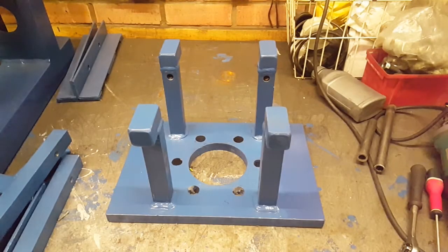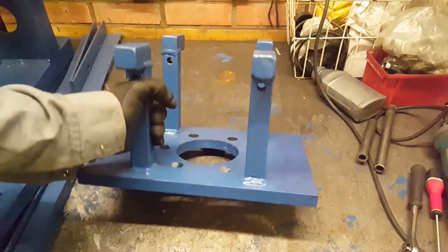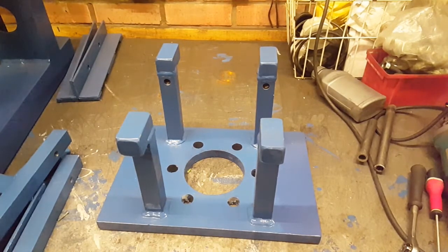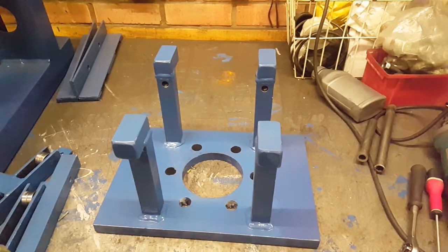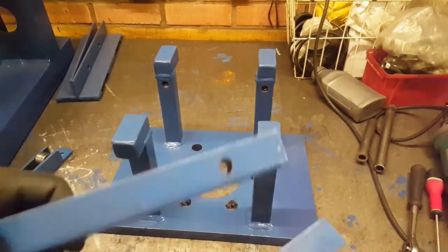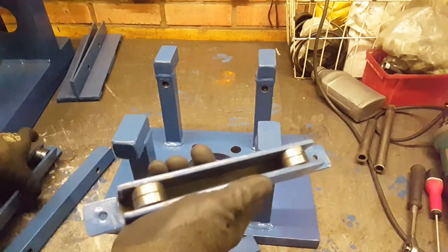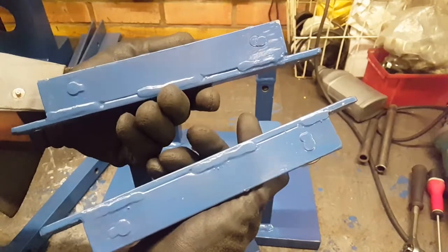This is the carrier for the cylinder. It was a piece of 20mm plate that I had cut — it's all laser cut, because there's no way I was going to do that with my plasma gear. It was 15 quid including all the cutting — I just gave them the dimensions of the cylinder and they did all the programming. I've welded these bits of 30mm solid bar on, and I've got two little trucks with cheap Chinese bearings which do a top job. They're just welded in — I'll never need to take those pins out.